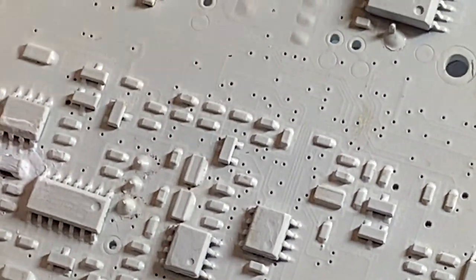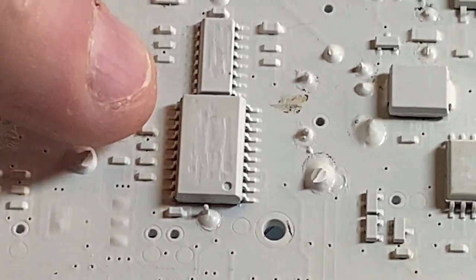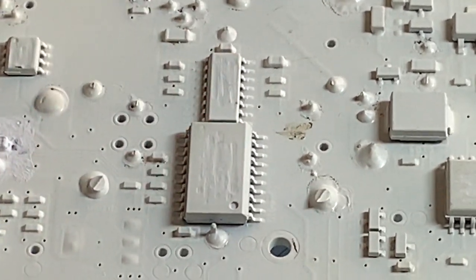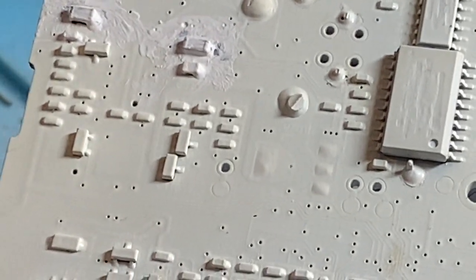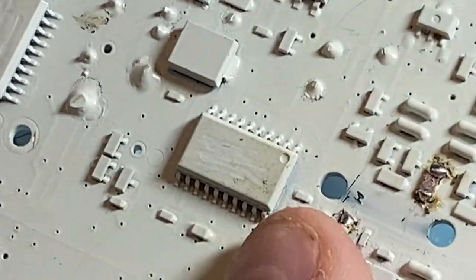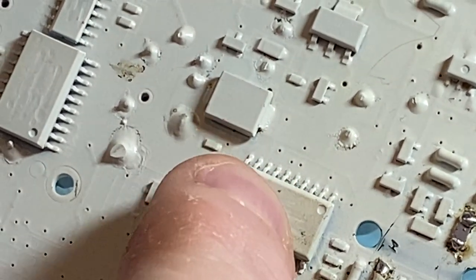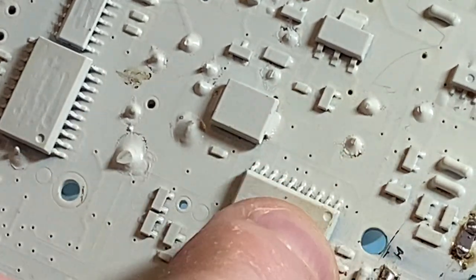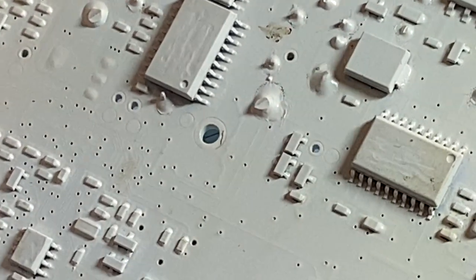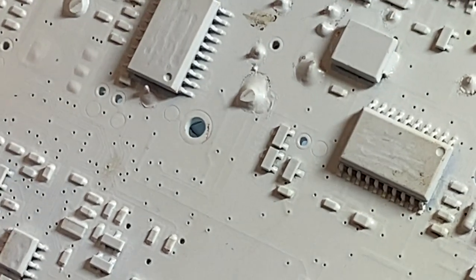But some of the stuff's really simple. If you get this chip here and you measure it, it's funny, all these legs on one side are connected and all those ones are connected, except for two power pins. I wonder what that could be. Might be a 4040. This one here, it's an expensive chip. That's the ADG333. That can switch multiple levels of voltage through it, and it basically controls all the switching functions for turning MOSFETs on and off, turning your receive lines on and off.